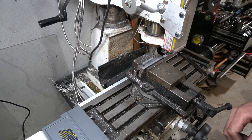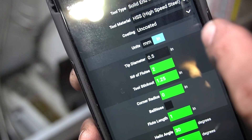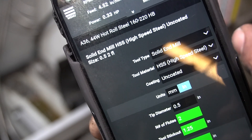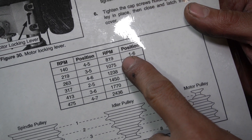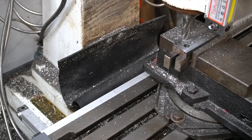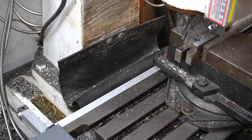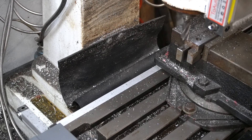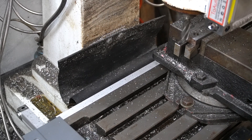We've switched to a regular end mill. The app says we need 841 RPM and 4.5 inches per minute with a high-speed steel solid end mill, uncoated, on hot-rolled steel. I've set the belts to 819 RPM — as close as I could get — and the cross feed between settings 1 and 2. This should give us a nice even finish at about a 10-thou depth of cut. The first cut was roughly half the width of the end mill; now we'll go full width and compare the two passes.